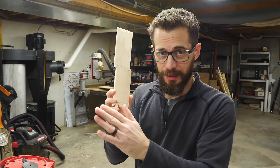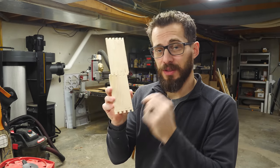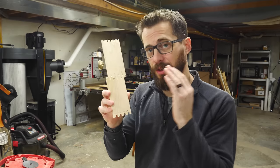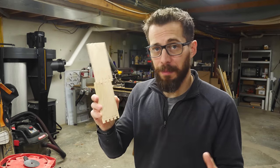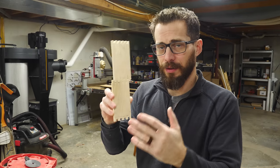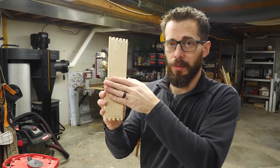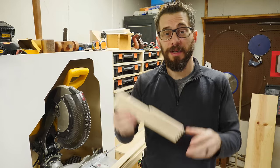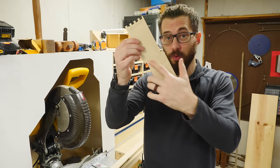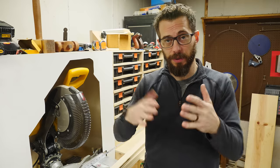The front side of those cuts look great, but I wanted to make a point because the back side actually doesn't look very good. This jig has a big opening where the blade goes through, and that causes a lot of tear-out on the backside of these cuts. That may not be a big deal if it's on the inside or you don't ever see it, but if you need clean cuts on both sides, make sure to put a backer board against the backside of these pieces before you cut the fingers. I got my test finger joints done and they fit really nicely.